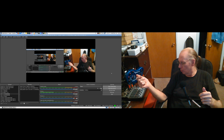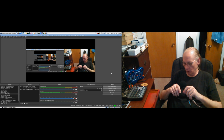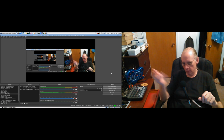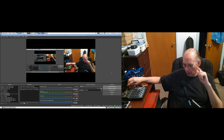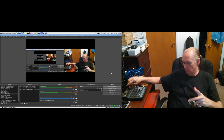But another option: I have adapters that'll let you plug it into the computer. That's what I've been doing. But that still does not work on my mixer, even with all the other adapters. Every combination I've tried two or three times. It's been a couple of hours each time, trying to find a way to do it. But you can buy one for $4 or $5, I found, that is made for that. It'll split the TRRS to a female 3.5 millimeter mic connector and then an earphone connector.